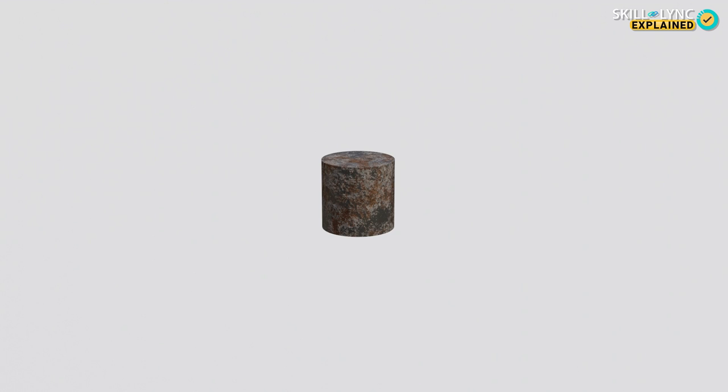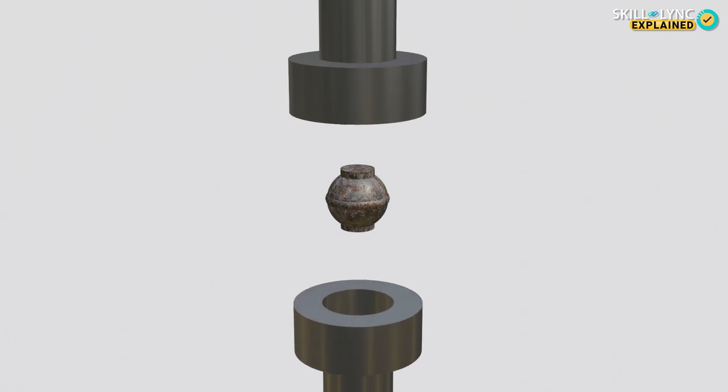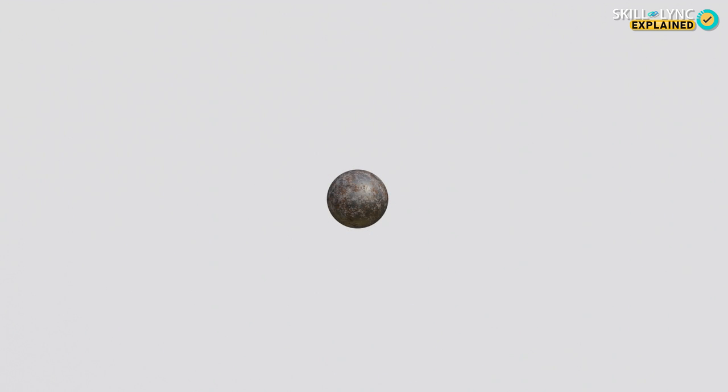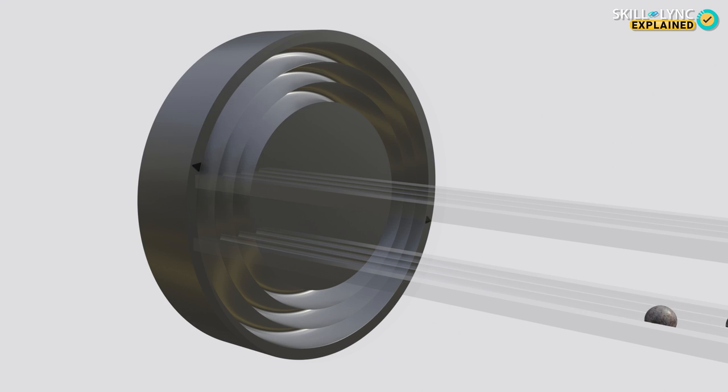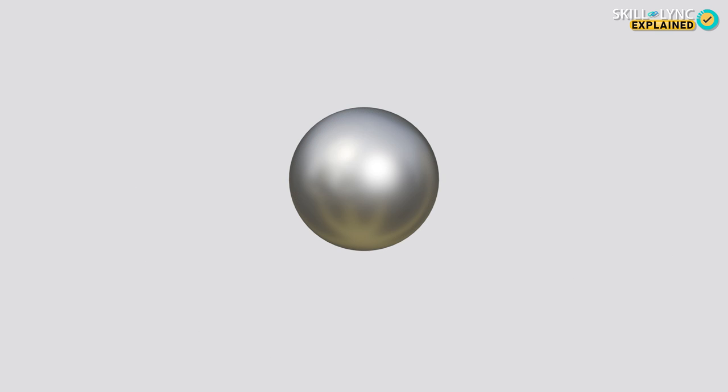What's more interesting is the way the balls are manufactured. Believe it or not, they actually start with a single rod which is cut into smaller bits called slugs. The volume of the slug is slightly larger than the finished ball. These are then pressed into shape by smashing them between two steel dies. The die lines are then removed using a machining process. The balls are then placed in rough grooves between two iron discs — one disc rotates while the other is stationary, and the friction is used to remove the die line. Further, the balls are treated to give them a smooth shiny finish.